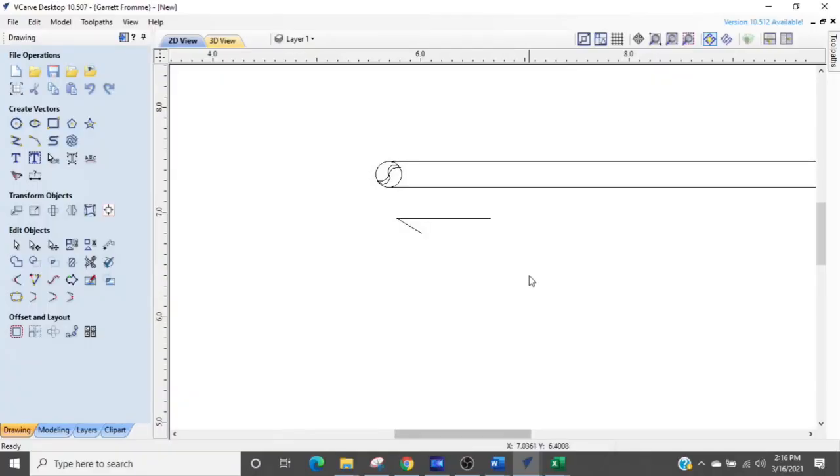Now, how does that translate more into the finish work of your project? Well, you've noticed on your projects that some areas will be nice and smooth, other areas will have these little steps and they'll go down and you'll get little burrs along there. Well, that's because of your tool offset or the stepover function that you're using. When the router bit is first making its cut, it is cutting 100% of the diameter of the bit through the slot, like the example I showed you before. But if you have a 40% stepover, that next cut is only cutting 40% of the material. And what's going to happen is it's not going to pull itself down nearly as hard. And because of that, you're going to end up with a step just like that.